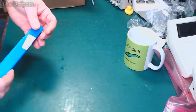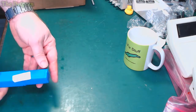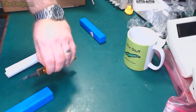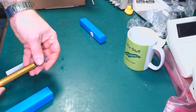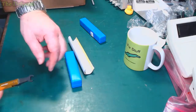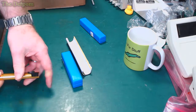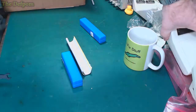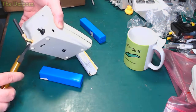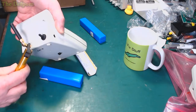What on earth is this? This is like an industrial kind of drill bit case kind of thing. Ah, it's a little torque spanner. So this is meant for doing up like SMA connectors, although this is a bit more chunky than I was expecting. So if you've got an SMA connector, like on here, the idea is you can use that to do them up and get the right torque, because it will just collapse over when it gets to the right one. That's the plan anyway.